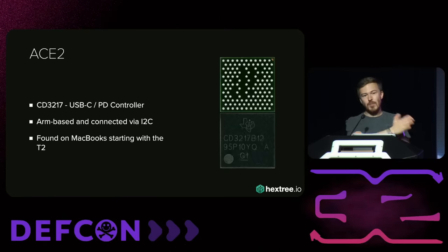Wonderful, in theory. The problem is we need to know the very precise timing on when to glitch. Otherwise, we're just going to glitch something else. How do we figure out the timing on something we know nothing about? We just know it doesn't boot, period. Brute force — I thought about it, but the boot is so slow it would take forever to try. And the more we try to glitch at the wrong point in time, the more likely we are to break the chip.